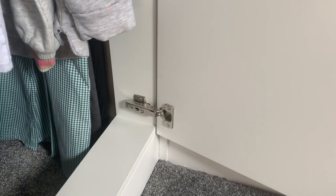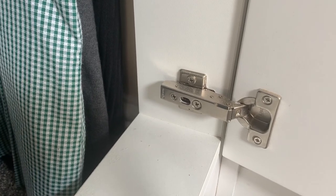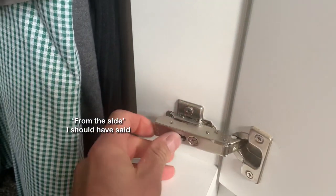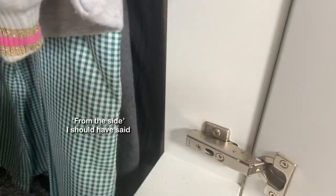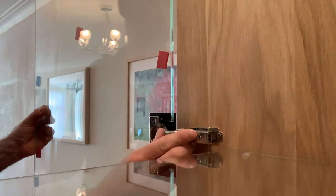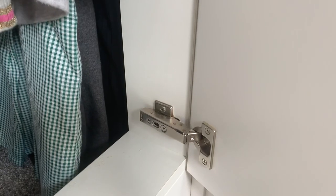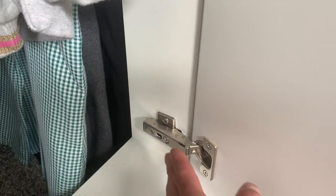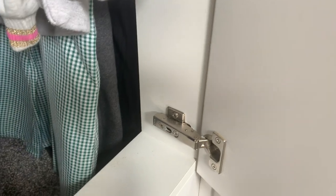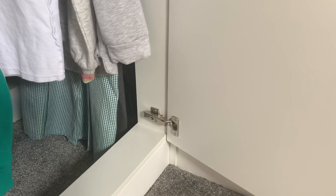The first distinctive I've come to really appreciate as a fitter is that unlike Blum and most other clip-on hinges, these will push on from the front and click on. So if you've engaged the upper hinges and you've got that last one that just hasn't clicked on, you can push it on. The Blum ones and similar have to hook on from the front — they've got to be a little bit forwards, engage into a hook, and then pop back. These have a much more forgiving engaging mechanism.